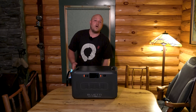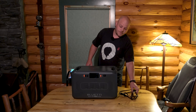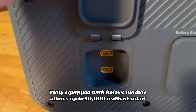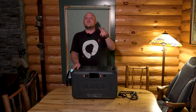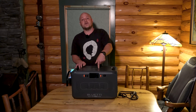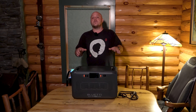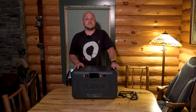They're including a wall charger built in like any other portable power station — you plug it in and it charges from the wall. It also has two MPPT solar charge controllers, good for 1200 watts each. With two of those controllers, you could run 2400 watts of solar, or run a solar array on one port and use a car charger or wall charger on the other. Obviously everything is top of the line on the charging side for this system.